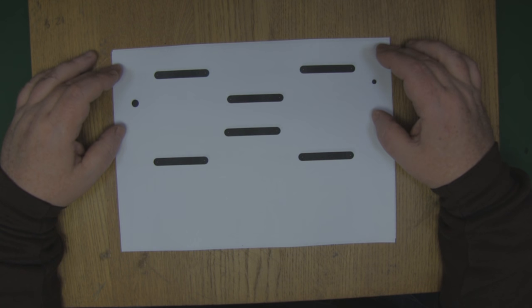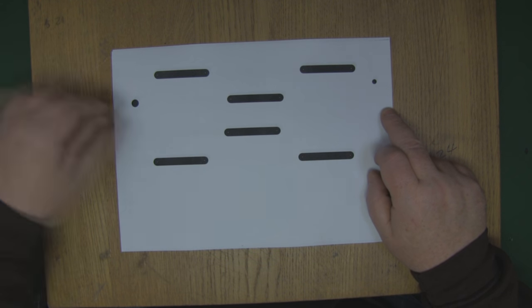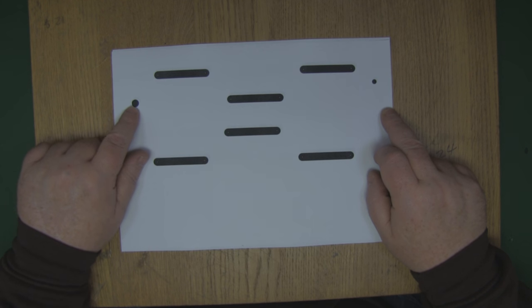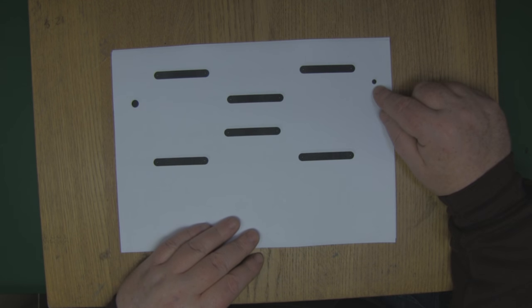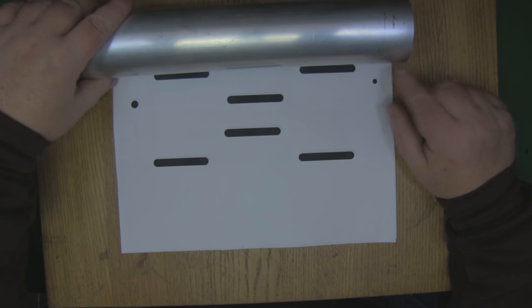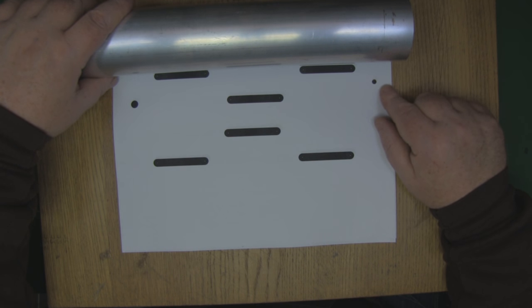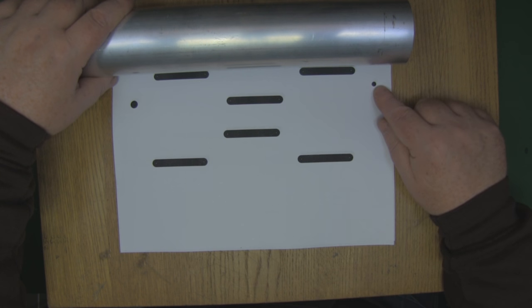I'm going for six slots this time. You'll need to cut the template here — these three can be positioned here, and the first slot lines up with this circle so you know they're at the correct distance. There's also a hole here that needs to be 14 millimeters from the start of the tubing. On the template it's at around 20 millimeters due to printing, so you'll need to measure 14 millimeters and start laying your first template from that feed hole.